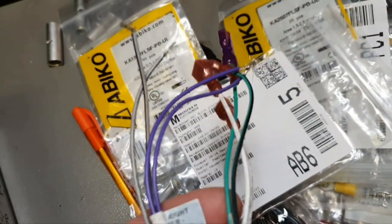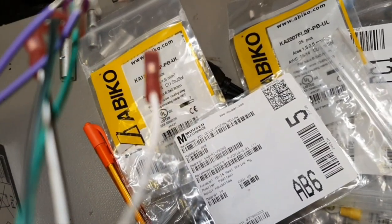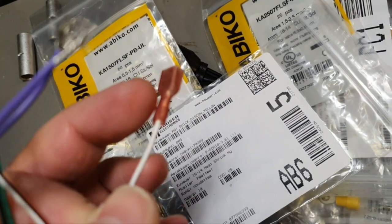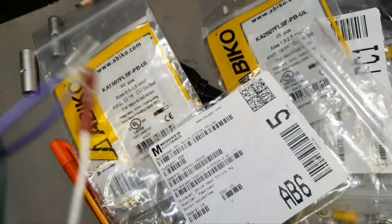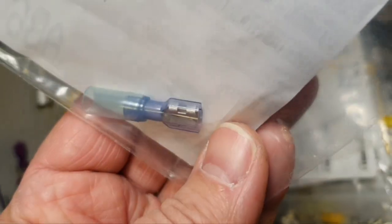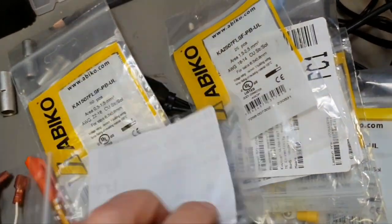As you have seen, if you use the right tool, then it will do the right crimping. The cable is not held, strain relief is not created, of course. In that case, it's very important to use shrinking tube that will serve as strain relief. Or, actually, guys, I don't use that anymore. I found a really awesome terminal with shrinking tube on it, and there will be a link in the description about this one.